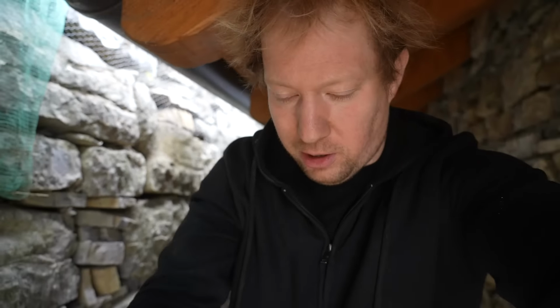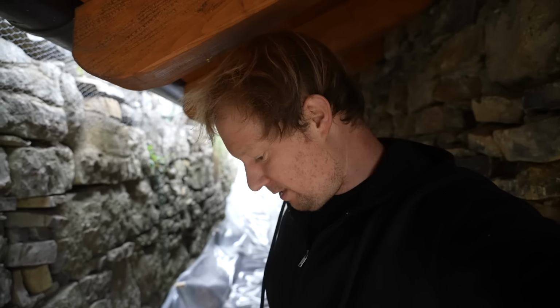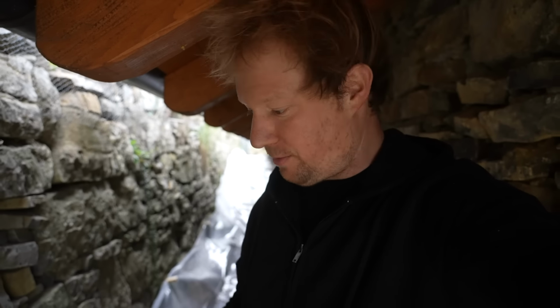Again, with a normal French drain setup, you would never put down a layer of plastic on top like this, but this is not a normal French drain setup. That French drain, again, is only to capture the water coming in from the side or coming up, but mostly from the side. And it's better to simply have the plastic and the concrete on top to block the water from coming in at all, rather than using the French drain. The French drain is that last line of defense.